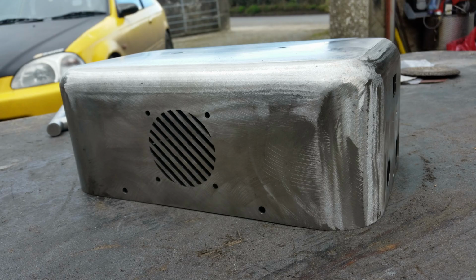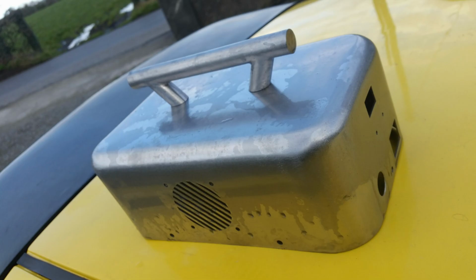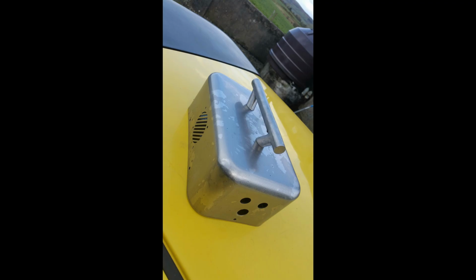As you can see there was a lot of work on it, I'd have got it easier just painting it at this stage. So here we are, still have to take out all these marks. There's four welds down each side. This is it being sanded with dual action, so I have to go to emery paper in here now, to take out all the rest of the marks.